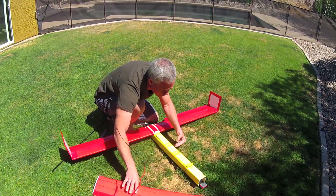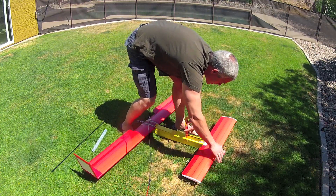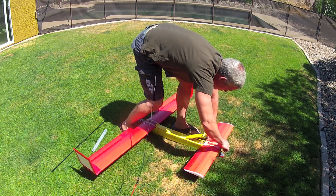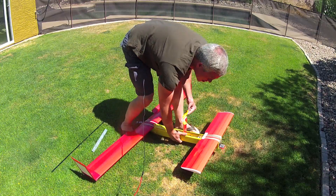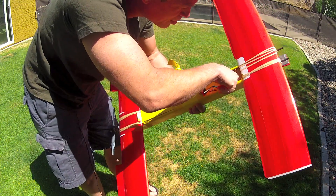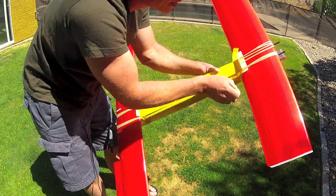Tape closed. And then for the canard — it has no control surfaces, therefore no wire leads. That's placed centered, and the rubber bands are placed over it. Batteries are placed in the nose under the canard right here. That typically is two 2200 milliamp-hour three-cell packs, but there's room enough for four stacked a certain way. There's even more room in this other location for more batteries, or that could be used for video gear for FPV purposes. And this is just magneted or taped down.